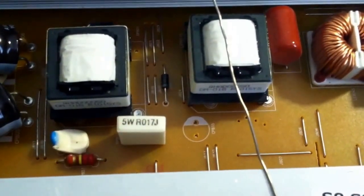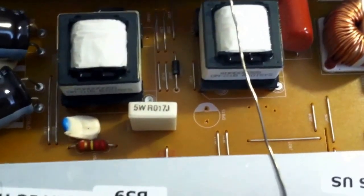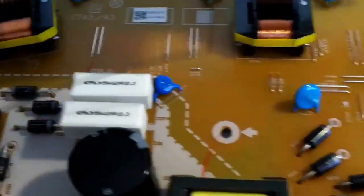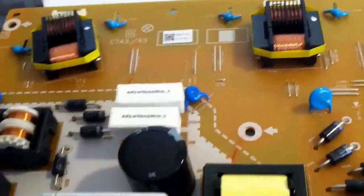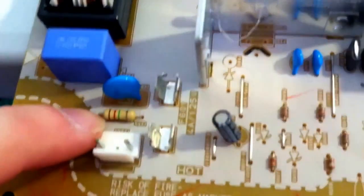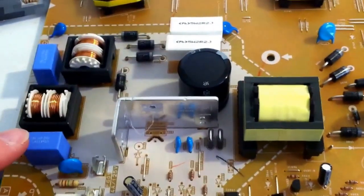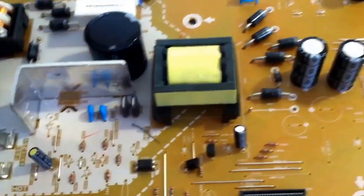It has a very low resistance — about 0.017 ohms. Notice the sizes: one is a much smaller casing than the other. These are power resistors used mostly in power supplies. You can also have the smaller 1/8-watt resistors in there, and here's a quarter watt for comparison. Power circuits and power boards use varied sizes of resistors for each application.